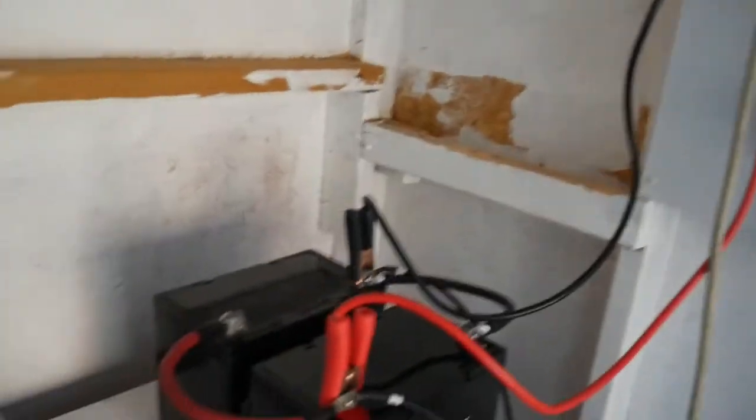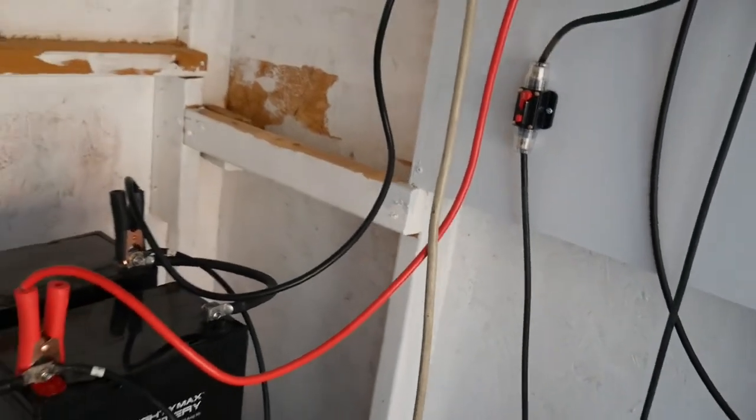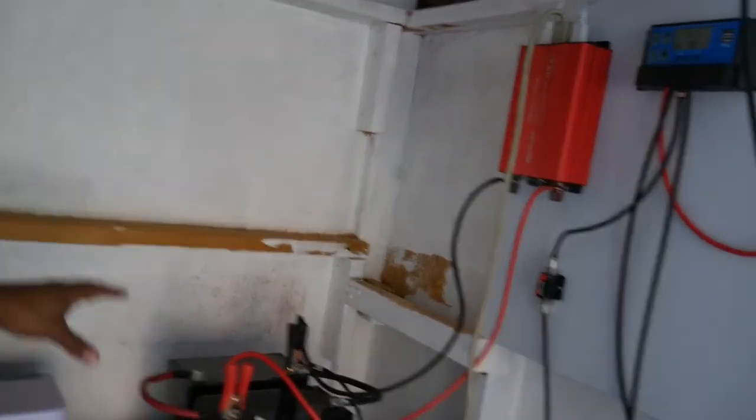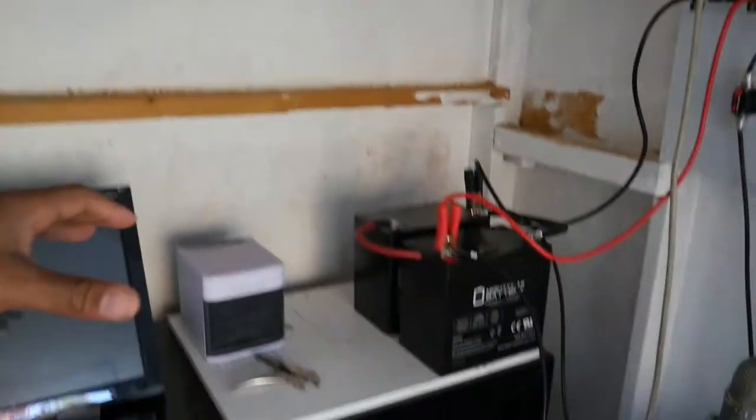I got a nice little monitor system. One of my batteries went out again — you've got to make sure you take care of your battery bank. Right now I have two, but I'm going to add three more batteries and get rid of one, because one of my batteries is over a year old. For good practice, if you want to add to your battery bank and the bank is over a year old, you might as well throw it out — the weak batteries will keep your system down. So I'm going to get three more batteries and get rid of one, and I'll probably have a 200 amp-hour battery system in here.